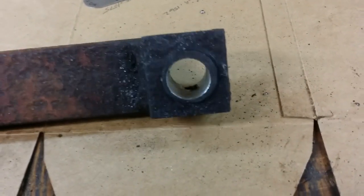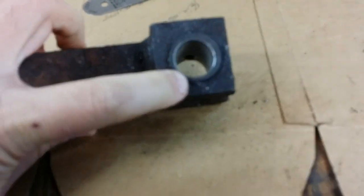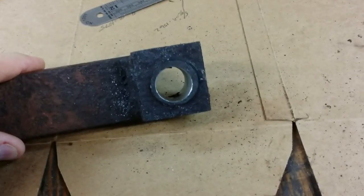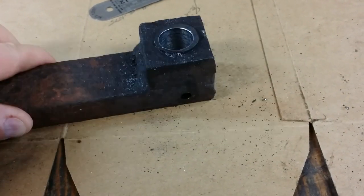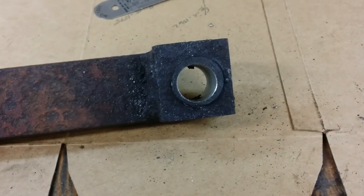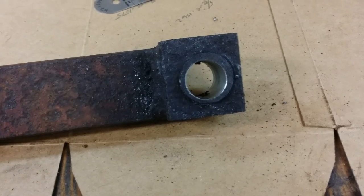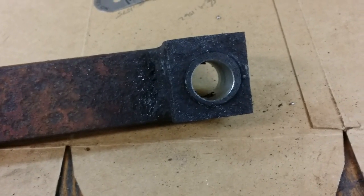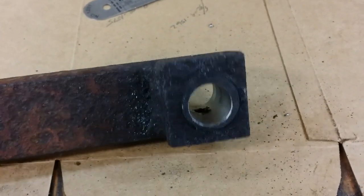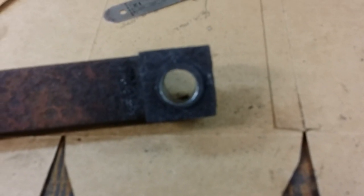My plan at this point is to put it in the vise and get my hacksaw - I'm going to very carefully make two slices in the thin portion of the bar stock in order to knock it out. Hopefully I can knock out about a quarter to three eighths worth of this bar and loosen it up. If I have to put some heat to it, I will. If I need to make another cut to knock it out, I'll do that too. I've got the little protective wood in there and I'm going to make a slice or two and see how it all works out.